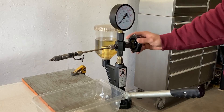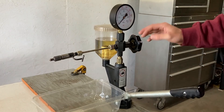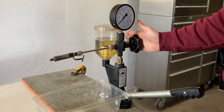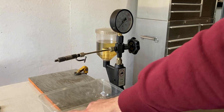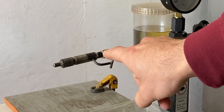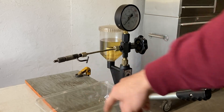Off to the right we can also adjust our valve. This hand operated valve will increase or decrease our pressure as we like, and we'll also be using this for our leakage test. Underneath I have a little drip tray in case you need to test multiple diesel fuel injectors — you want to loosen up that connector and you'll have a little bit of diesel fuel which will drip down.